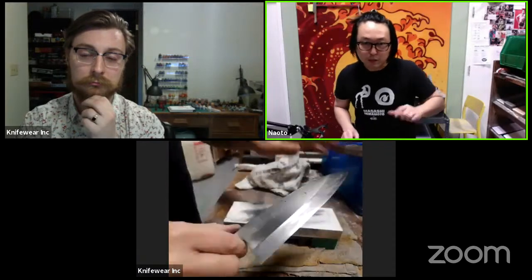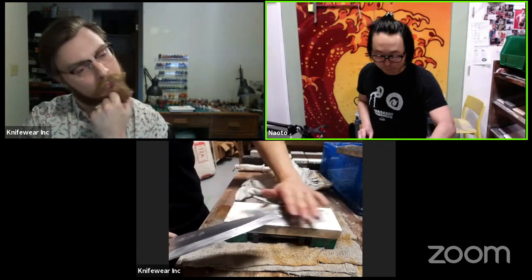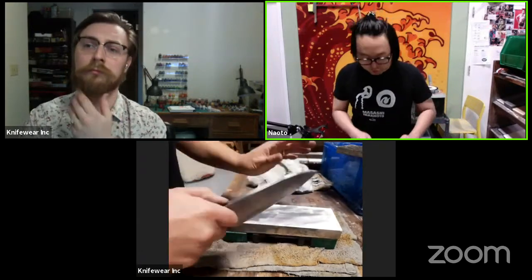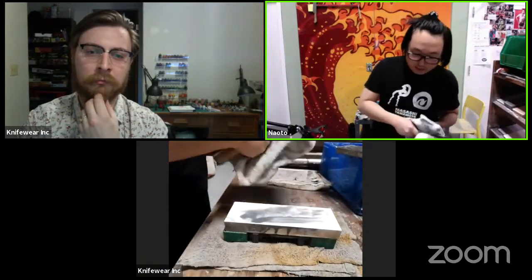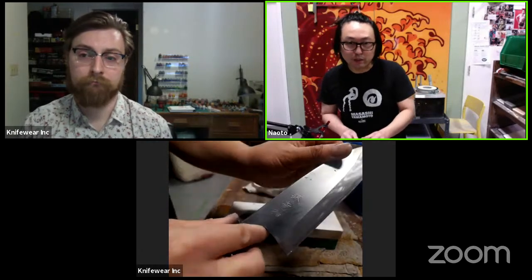Here, so this stone, the Kencho Itadaki, the ceramic hard stone, the 1000 grit. This one's great. After sharpening on the 220, I wanted to check how my convex is going. Grab something like a Chosera, or the Naniwa Professional, or the Kencho Itadaki stone like this. Make sure the surface of the stone is super flat. When you sharpen on these, this will show you that. When I was finished on the 220 stone, it did look more even.